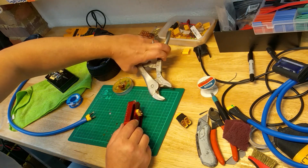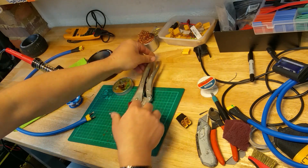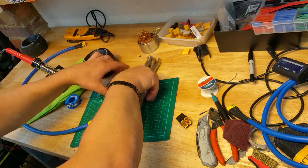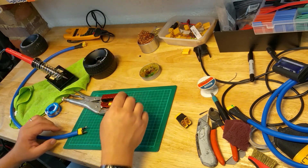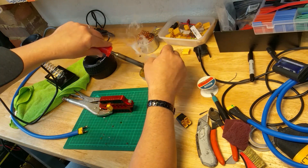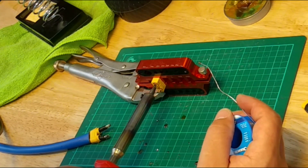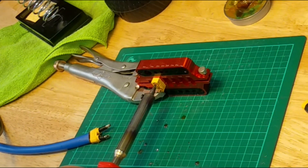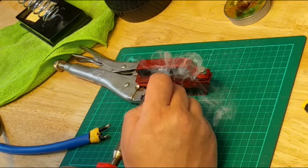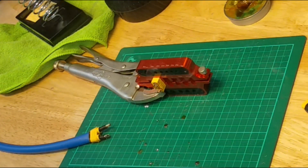I also use some heavy vise grips just to give this little tool a bit of weight, so when it's sitting on my table and I'm pressing cables into it, it doesn't move around. Now what we need to do is tin the connector itself. Warm up the flux and solder, put the soldering iron inside the connector, give it five or six seconds to warm up, and now apply the solder with a bit of flux in there. Because the connector is nice and warm and the flux is there, it will take the solder in quite nicely. So now we have pre-tinned the connector — beautiful.